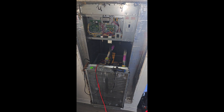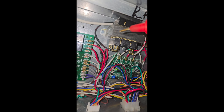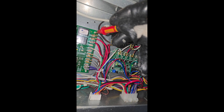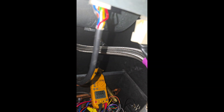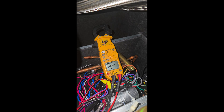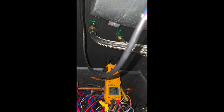So I finally pulled out the unit. I want to see what I have on my CC to ground. On my CC to ground I have 24 volts coming in — you can see my 24 volts on my voltmeter here. And measuring my W, I also have 24 volts.